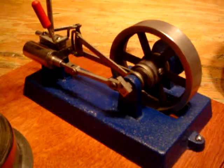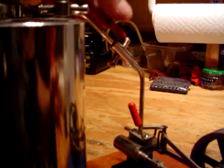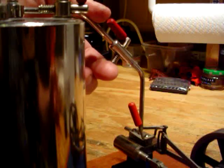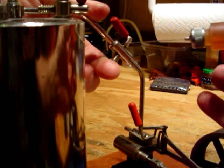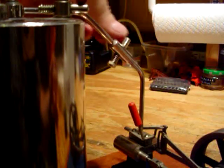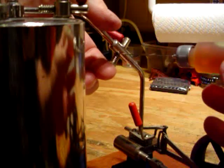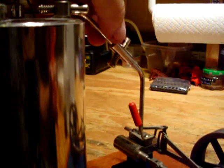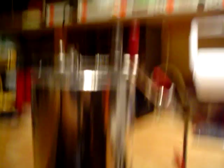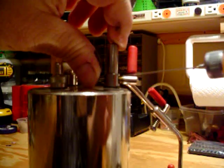One other place to put steam oil: each time before you run your engine, you have a steam regulator in the line. Press up on the bottom of that regulator — it's spring-loaded — and squirt some steam oil in at the junction at the top where the tapered part goes in. Get a little on there, turn it around, get a little more, turn it around, a little bit on the bottom. This helps to prevent drips from your steam regulator.